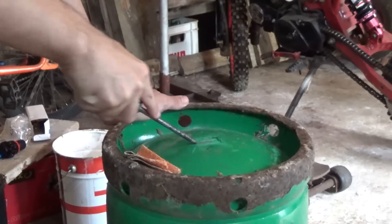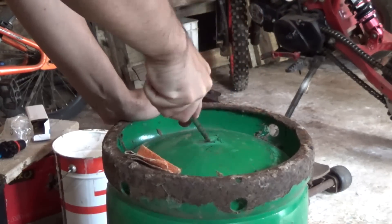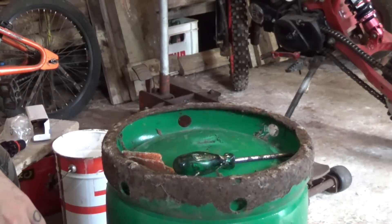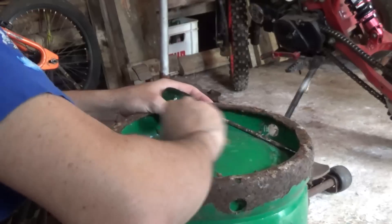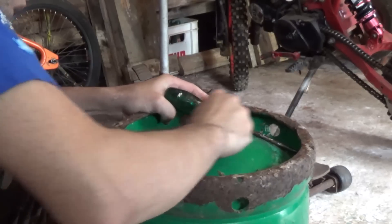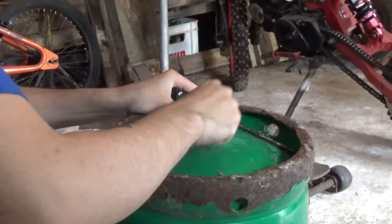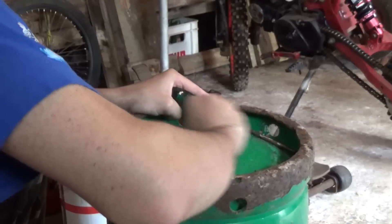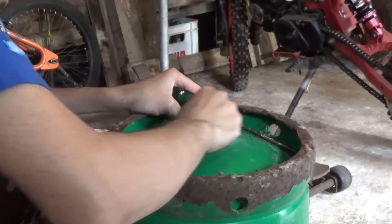This is not the kind of thing that you just get empty today and then you start welding right away. I've had this bottle here with no valve, open for like six months or more, so I think all the propane is gone now. It's pretty much all gone. Then I'll try and weld that piece and see how it goes.